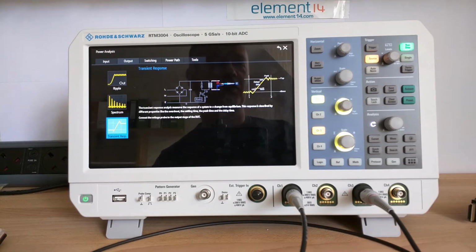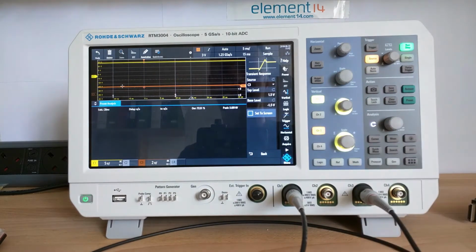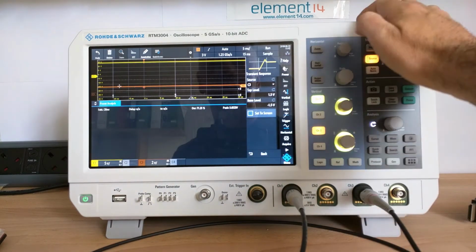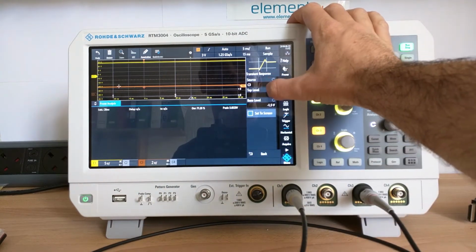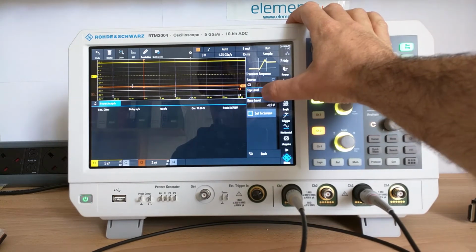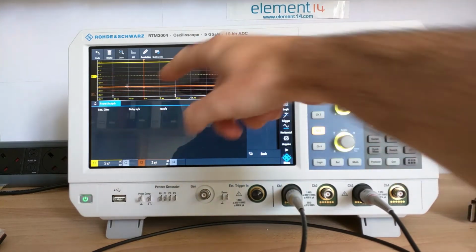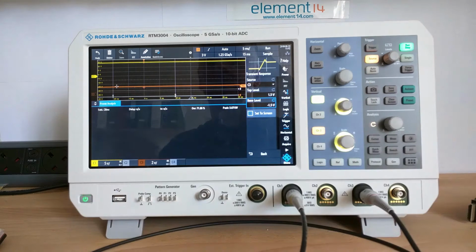It doesn't really say, so it's not very clear, but I think if you're not using a differential voltage probe, things start getting a bit weird. I couldn't really seem to get it working. If I try and set the top and base level, try and set the voltage, I get these little flashes of it popping up. I get measurements moving randomly all over the screen.